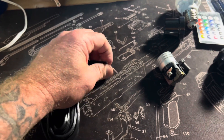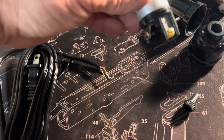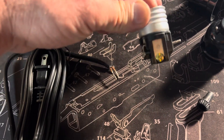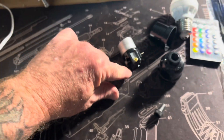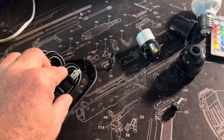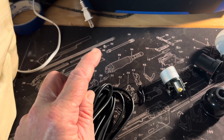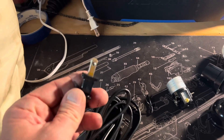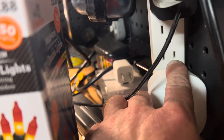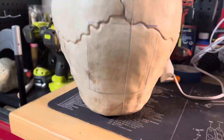If you're not comfortable with this, just get an electrician. When you pull the three-way plug apart, you've got a gold and a silver — or yellow and silver. The hot wire goes to the yellow or gold. If you don't know what the hot wire is: when you plug something into the wall, the hot wire — if your house is wired correctly — is the smaller prong on the right. That's what you connect to the gold or yellow.